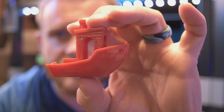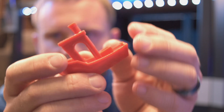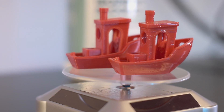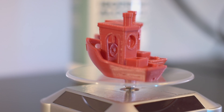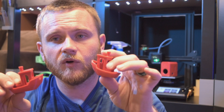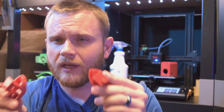As you can see, we have this nice smooth, super glossy, almost soft-feeling texture. It looks like I sanded it and sprayed it with some kind of clear enamel. It gives it a really nice smooth texture. You can still see the coarser layer lines, but anything fine disappears completely. This is after just one spraying of isopropyl alcohol — I can see that doing it three or four times would make it completely smooth.